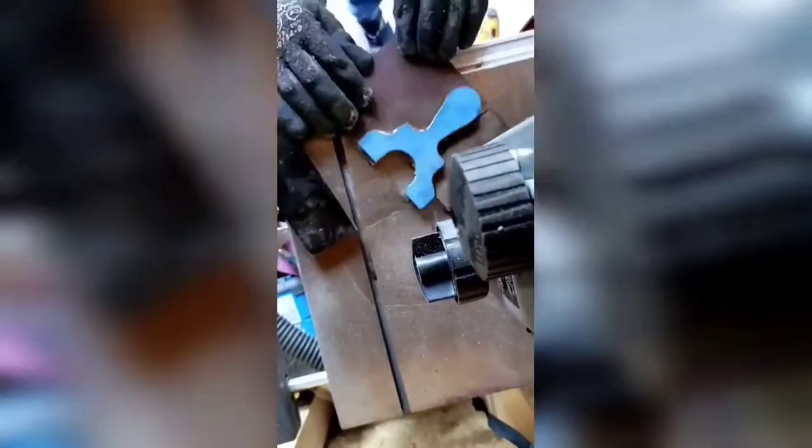I then used the 2-part epoxy to adhere a scale on it, and with this one I used a sheet of multi-layered carbon fiber. And once that was dry, I used the bandsaw to remove the excess pieces. I think it was about a 1/4 inch thick, so it took a little bit longer to cut out, and it did look really good. I was very happy with this material. It's very messy to sand too though, but I guess that's some of the price you pay, right? It pays to be beautiful.